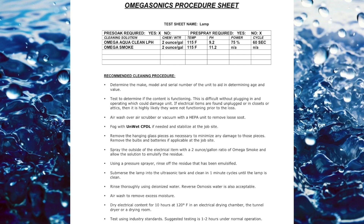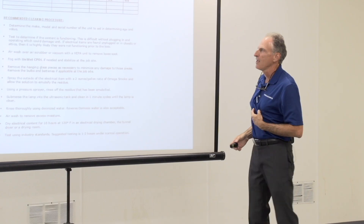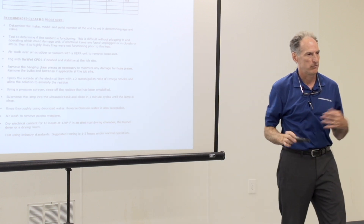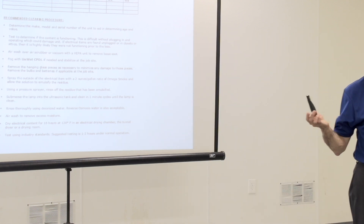The process is a little bit different here. We're going to run a temperature at 115 degrees. We're using AquaClean LPH, which is low pH, and the reason I'm using a lower pH is I don't want to damage the solder joints — the lower pH is a little more forgiving on them. I'm going to run 75% power and still run for a minute. You'll notice I have Omega Smoke in there, but I mentioned you don't necessarily want to mix the chemistries.